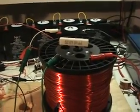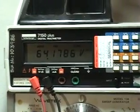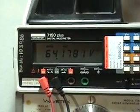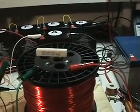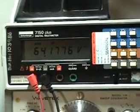I find that interesting because we're drawing — as far as I'm concerned — the same amount of load on those batteries, since their voltage has hardly dropped. We were at 64.1861 when I disconnected, and after running two to three minutes we're at 64.1783. I've tuned it so the voltage is dropping at the same rate as when it was connected directly, and yet we're energizing a coil, which you'd think would add wastage — but it's not taking any more power.